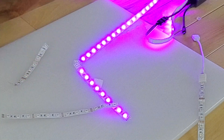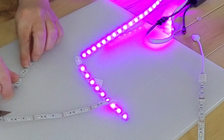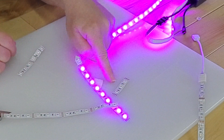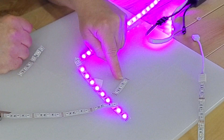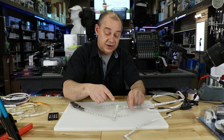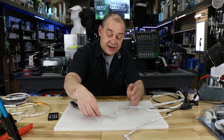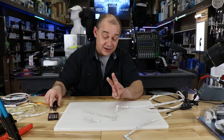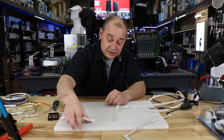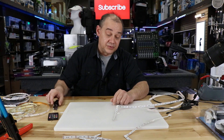That is what your lights can be down to — three lights, that is one set. This is a 12-volt package, so it runs three at a time. If this was five volts, it would be one diode; if it was 24 volts, it would have had six — it's just math at that point. Two out of three times it didn't work, so buyer beware. Always test it at the end of the roll if you plan on doing any pleats. Waste a little bit at the end — don't try doing it right in the middle or you may ruin the whole strip.